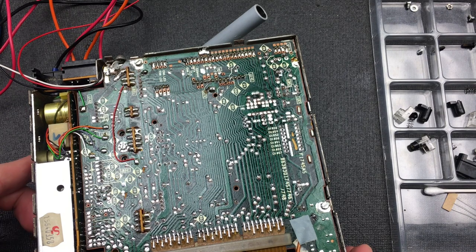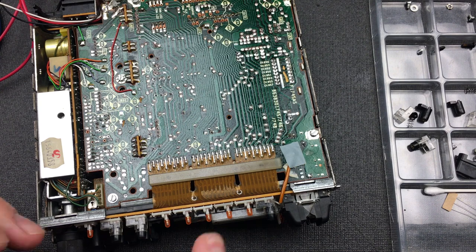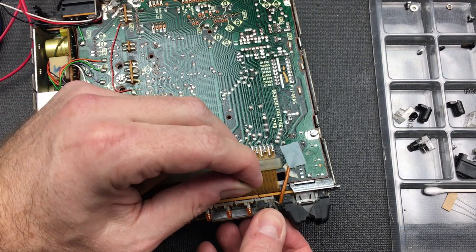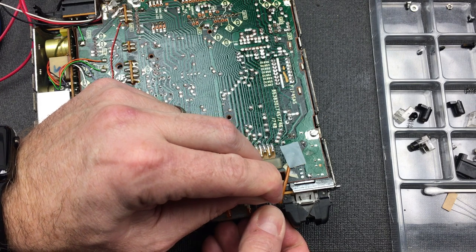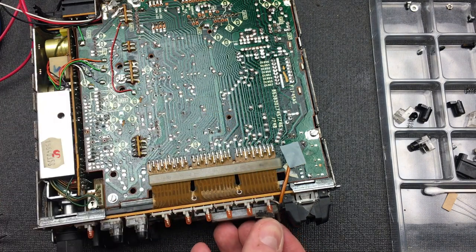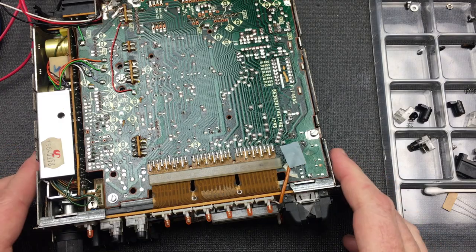Alrighty, I seem to have found a technique that seems to be working for these top buttons. I can't get the screen off. Basically, I unclip the top half, then I slide a pin down right beside this plastic to push on the transparent plastic beneath. There we go. And that then releases the button. Wow, that's a lot easier. What a mission.